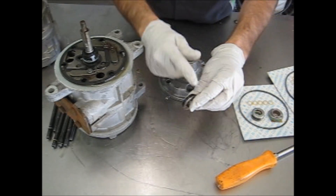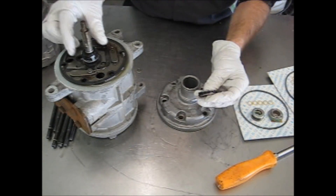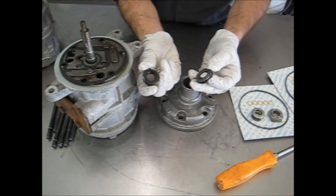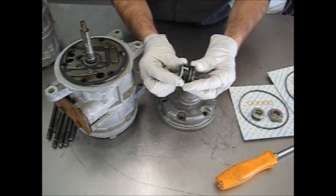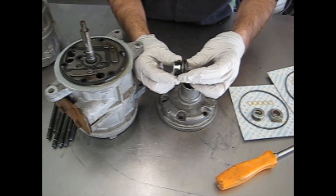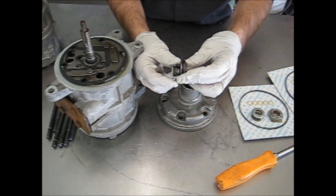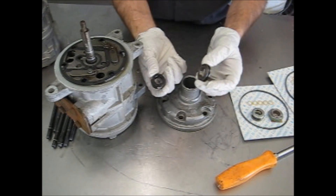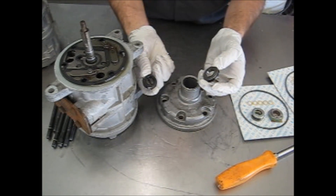This seal has an O-ring around it, which will seal it into the nose itself. The way a carbon ceramic seal works: this carbon seal rides on a fine layer of oil, which rides the machined steel surface on the back. As that crankshaft spins, it actually seals itself on that front metal plate. Therefore, oil is very important. Also, while handling these seals, do not touch them with anything but latex gloves. Your fingerprints can actually etch into the seal and create a leak.